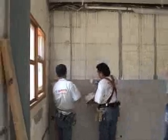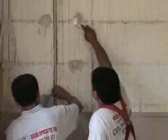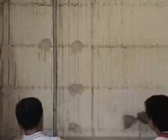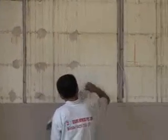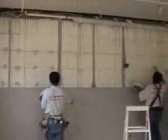Okay, the guys are now setting up on the next level up. And one thing to note here, it is better to actually put it right at the join level, because what happens is there's a little lip there. If I just zoom in, you might be able to see it. A little lip from the block below. That actually stops the corner cement sliding down. With the 300 joints, 300 level heights on the actual blocks themselves, it makes it quite easy to set it up.